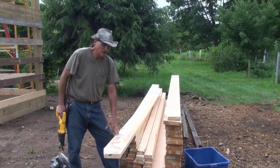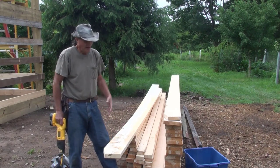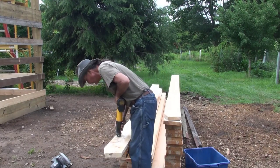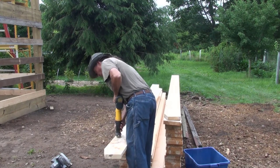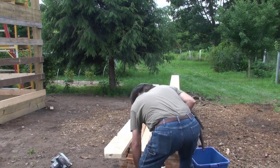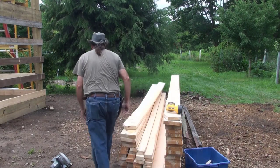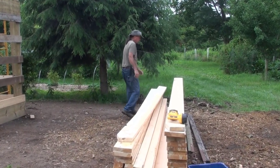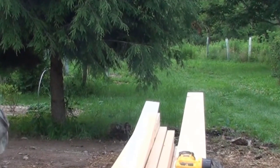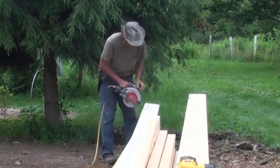Most carpenters, people in the business, usually just drive the circular saw a little bit further in the bird's mouth, cutting into the rafter some, so you'll see these two little crosshairs. I'm just anal retentive, so I don't do that. So I use the second saw. Here's the top bird's mouth I'm going to cut out.